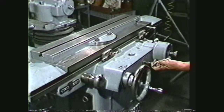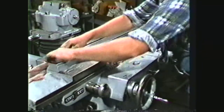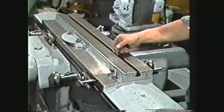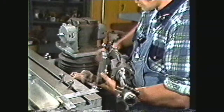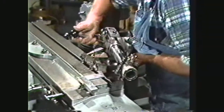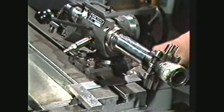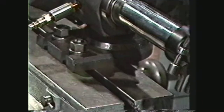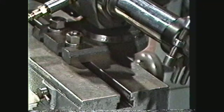Open the saddle until the buttons line up and then lubricate the machine. Clean the table. From the right side of the table, slide in two T-bolts. Then clean the bottom of the fixture. Mount the fixture outboard, square to the table with a machinist square, with the base ears extended at least one inch over the edge of the T-slot. This overlap will keep the fixture from rocking.